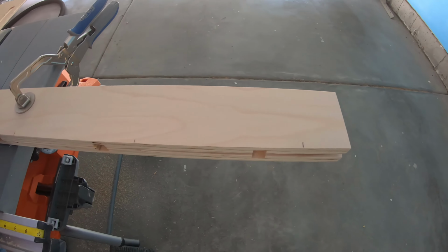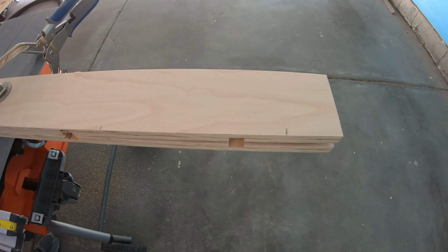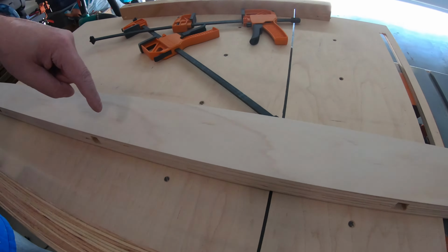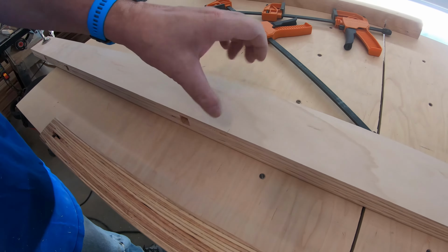All right, so I have 8-inch shelves and 18-inch shelves. So we've marked 2 inches above the 8-inch and 3 inches above the 18 because they have bigger bottles. The other one has cans. So we've marked them all. Now we're going to take them over to the drill press and drill a hole down through, but it won't go through the other board, because that's the holder, for the dowels. And I figured that edge is against the wall.